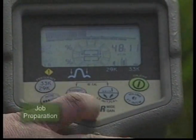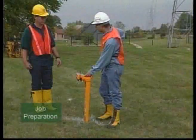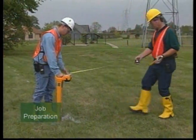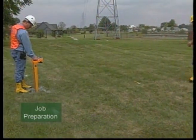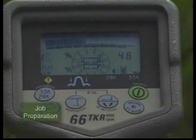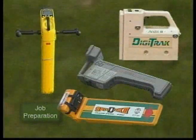Use the following procedure to determine if electromagnetic interference will affect the readings of the tracking receiver. Where interferences were detected, position the receiver over the planned bore path. Position the transmitter off to the side at a distance of 1.5 times the planned bore depth at that point, not to exceed the maximum range of the transmitter. Check depth accuracy and other communications, such as pitch, roll, battery life, and temperature. In the event of inconsistent or inaccurate readings, contact the equipment supplier or manufacturer for recommendations.